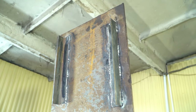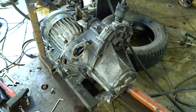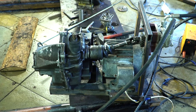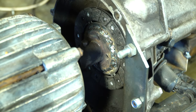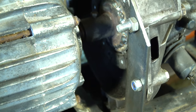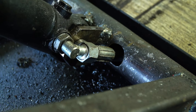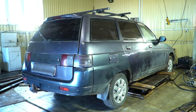Unfortunately, the gasoline engine didn't want to work without a gearbox and failed. We decided to replace it with a 2 kilowatt electric motor, which definitely needs a gear system. It was made from a gearbox in which the differential was sealed. All components were placed on the frame. The electric motor connects to the gearbox through a clutch to which a clutch disc has been welded. The torque is transmitted by the drive into the gear pump. The hoses from the hydraulic cylinders were passed into a pipe to avoid being pressed by the platform.